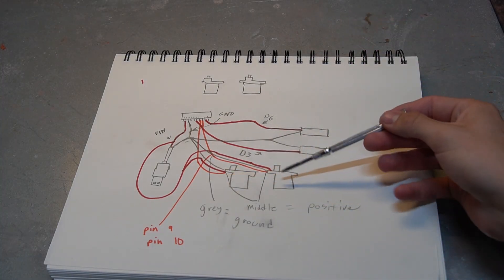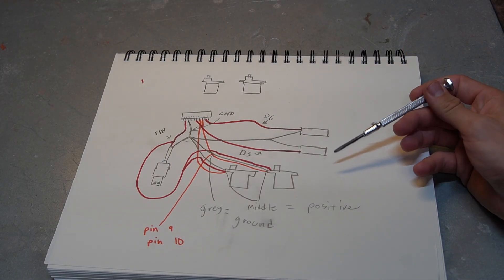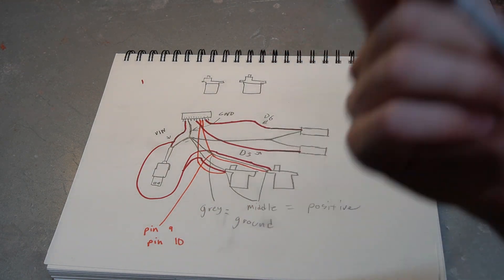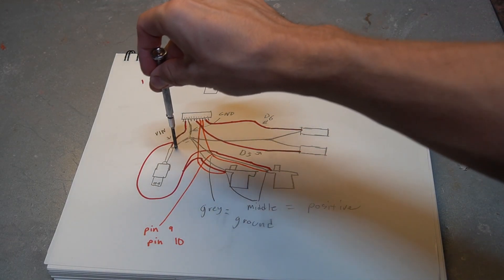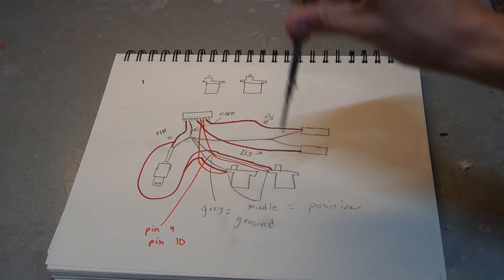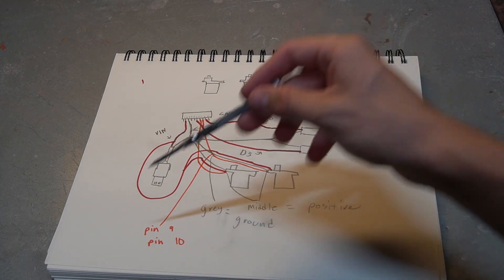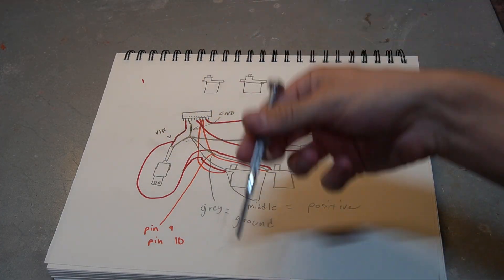After all the trial and error, it's time to wire this thing, which is the fun part. I needed to draw a wiring diagram because I had no idea how to start. These are the two servos we're going to be using, and the three wires coming out of them go to different areas. These two things are the LED eyes, and they all connect to our Arduino Nano, which is a microcontroller that lets us add code to control everything. All grounds connect to our USB battery ground. The positive for the eyes go to pins D3 and D6, and the positives on the servos go to pins 9 and 10. The red wires meet at the positive on our USB charger.